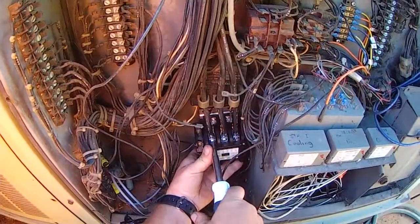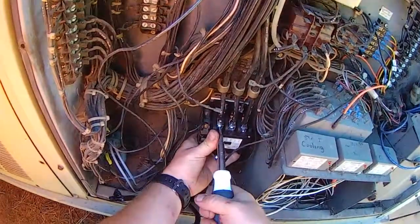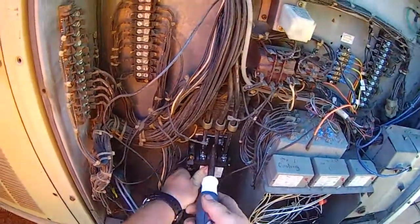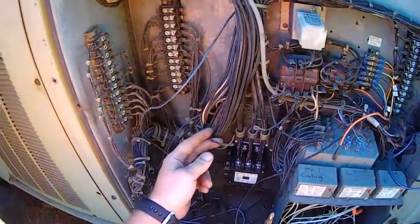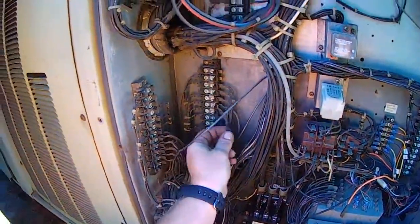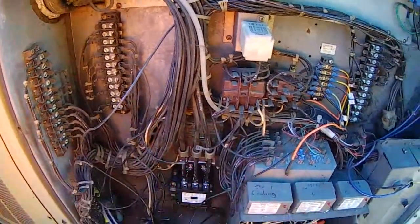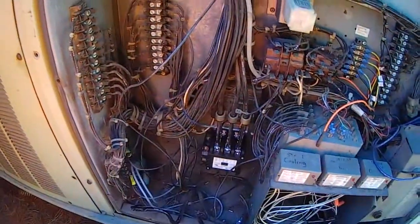Tightening those down really tight. There's a busted wire — I have no idea where that goes. If you're going to cross something like that, trace it in a circle to see where it connects. It looks like it connected there, but then there's nothing for this to connect to, so that could be a hazard. I think we're going to tape those up — may be in use, may not be.